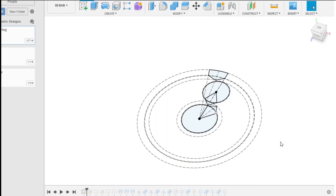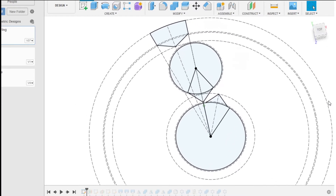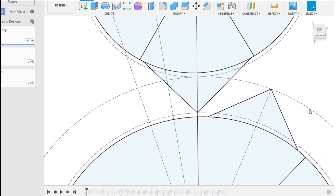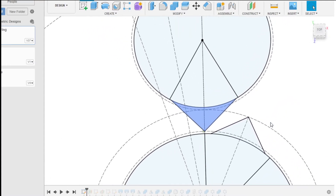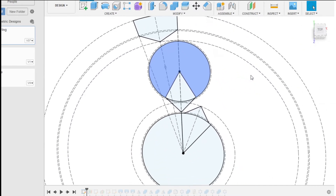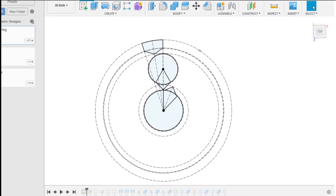So three primary sketches make up the design. Here's the first one — this is the base layer, the very bottom of the bearing. You can see small gaps in between where the teeth of the gears fit together. And this is all done in sketches that are defined parametrically in parameters in Fusion.